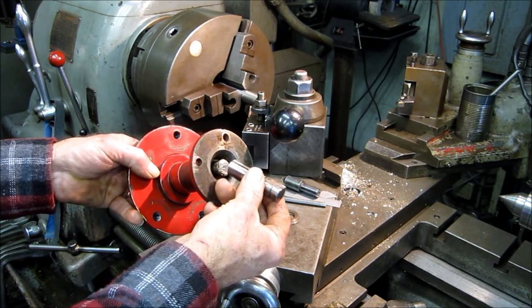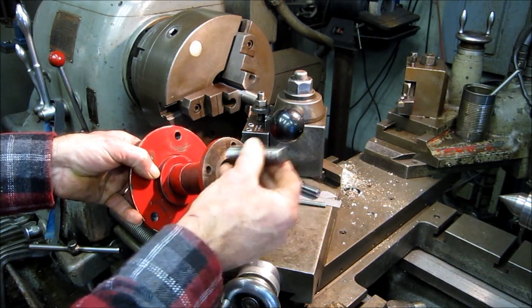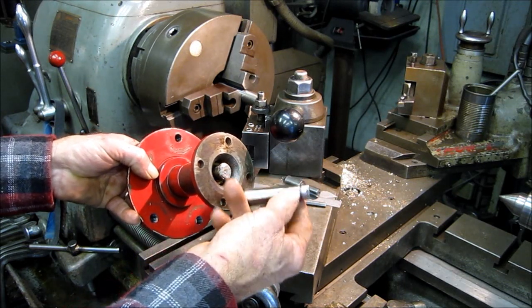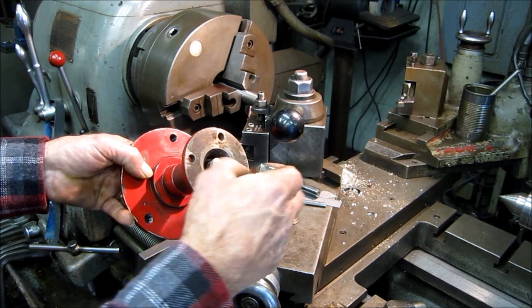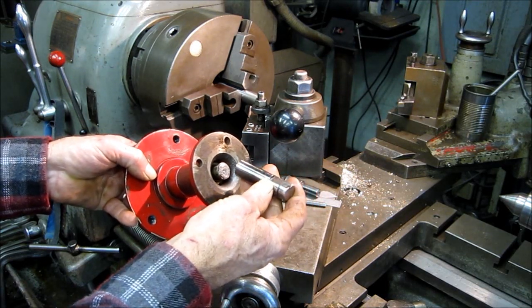What we're going to do — he tried to create a snap ring right there to create a substitute for the actual keeper. Today we're going to make him a new shaft, but we're going to put a shoulder boss in here so that it will hold the thrust there and not be a weak point in the shaft.